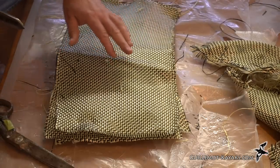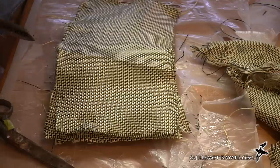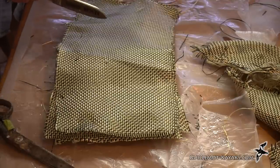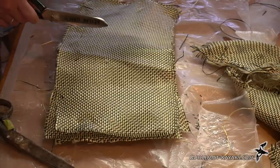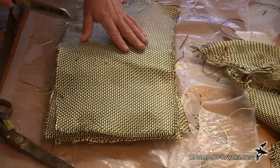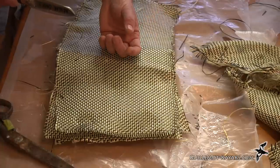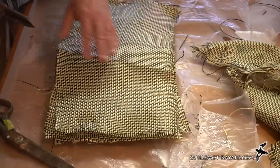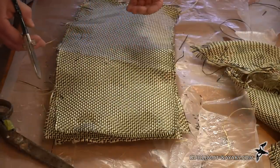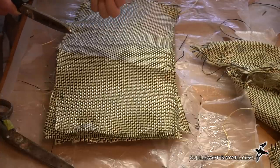It's very tenacious stuff. The carbon Kevlar on the hull of the boat will hold the boat together even when other fabrics fail. Even after the bond with the epoxy and the Kevlar has failed, the Kevlar will still be there holding everything together. Where the carbon fiber breaks in a clean break and the fiberglass will completely separate, the Kevlar holds together and is very tenacious.